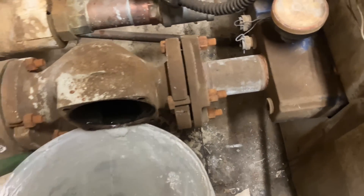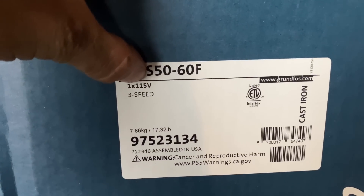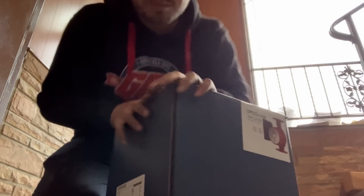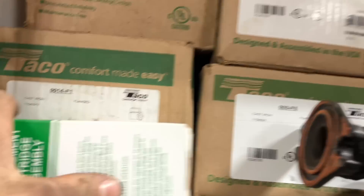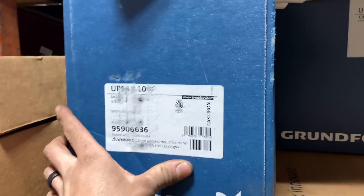Kind of a job — eleven-inch gap, and I could always shorten this nipple if I need to. Looks like we're going to put a Grundfos pump on — it's a go. I think this might be my pump: three-speed, 115V — that'll work. Unfortunately, doesn't look like we got the right pump. All we really have are double-007s, double-010s, double-009, double-014, and some of these bigger Grundfos pumps. We're going to have to order the pump, probably some flanges, redo some of the piping a little bit. It's almost four o'clock — that ain't going to happen today. Until next time, take care.